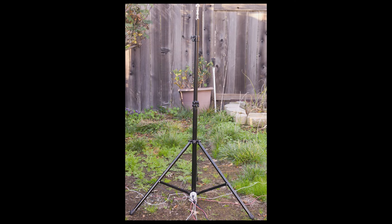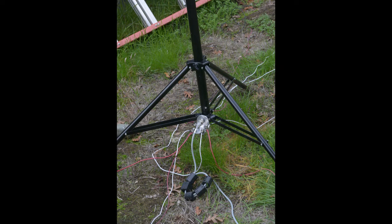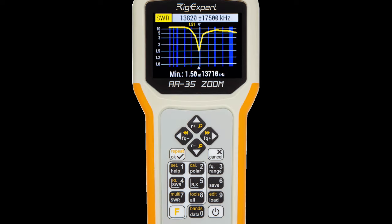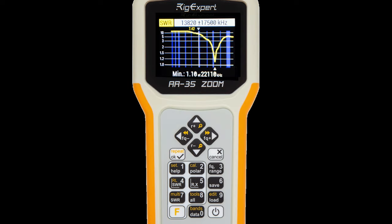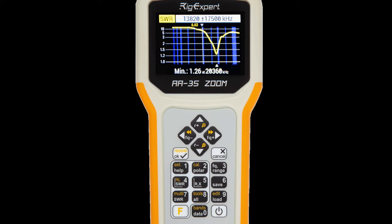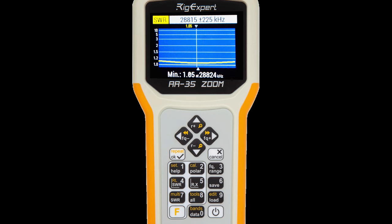Here's the tripod out in the weeds with some special rubber feet on it and the radials fanned out — just kind of helter-skelter to see if I could get it to resonate before it rained. I added some beads for a common-mode choke. On 20 meters I got about 1.46 to 1.5 SWR above and below the band. On 15 meters I got it pretty close. And on 10 meters it was flat across the entire band with a really good SWR on most bands.